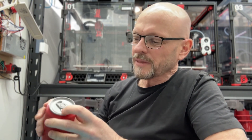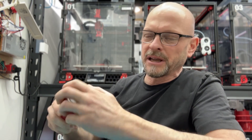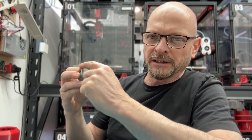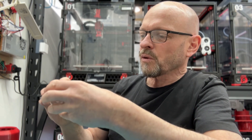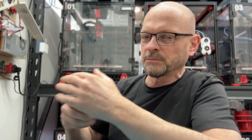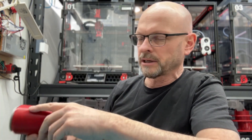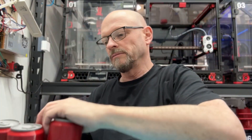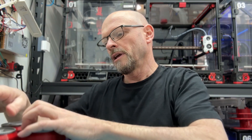Once it's on, it's on — it's pretty solid. A friend knocked the tab out once and it was permanently locked, so I printed a key. If that happens, there's a key to open it. Otherwise, just press in, rotate, and turn the top counterclockwise and you're in. I added a little knurling on the outside of the top to help with grip — without it, it was too slippery to open.